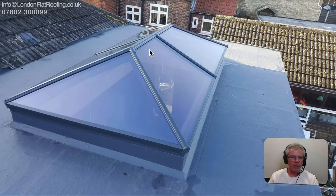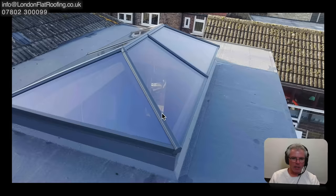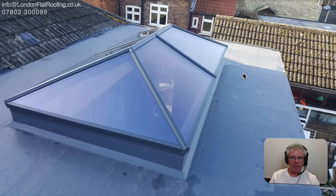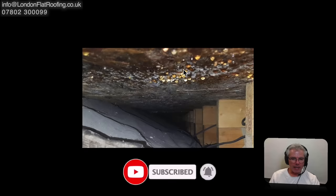I've been sent some fantastic photographs from a customer who's got a sweating roof. This is the roof he's built — he hasn't finished the building side yet, and luckily enough he hasn't, because I can already see interesting problems. There's only one airbrick here. On the outside there are no air vents, so you'd think it's a warm roof, but looking inside — insulation running across below — this is formed as a cold roof. And we can already see damage.